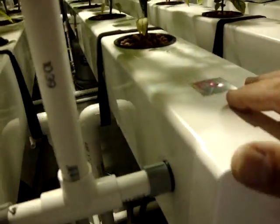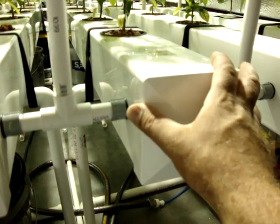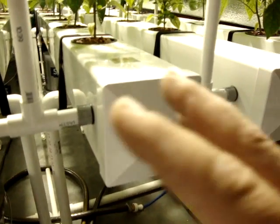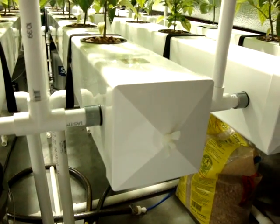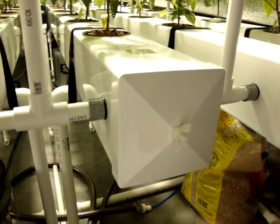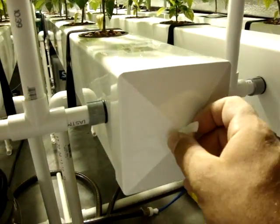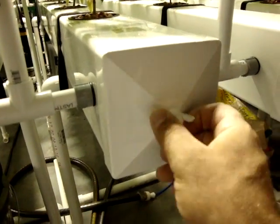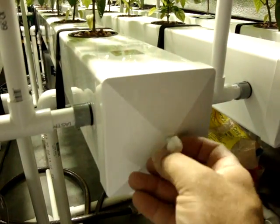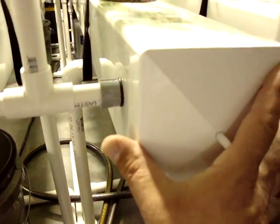Back to the rail - five by five post, two end caps. A lot of manufacturers will glue the ends in place, which is fine. But I wanted a system that was easily broken down, easy to clean, take apart, and get to all the intricate parts easily. So the first problem was coming up with a way to deal with the ends. What I came up with is this little T piece - it's a nylon wing nut that goes to a nylon bolt that I drilled into the center of the cap.